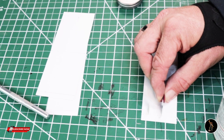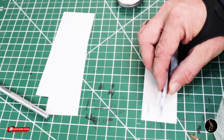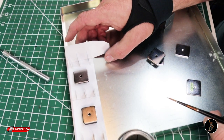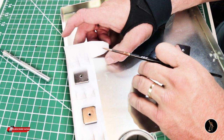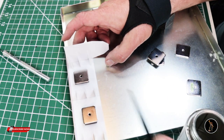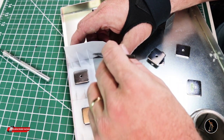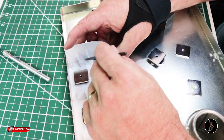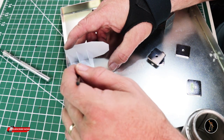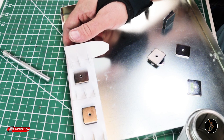I'll use this a lot in builds but I'm not going to show it every time - I'll show the technique and then show the result after the fact. This is a very useful jig. What I'm doing now is butting it up against the side, putting a couple magnets on there to pin it in, then getting some Weld-On on my brush and going up the sides so it tacks on - doing it along the bottom as well - and just holding there until it's firm and tacky.